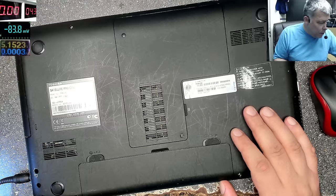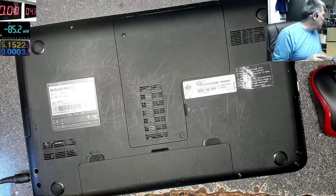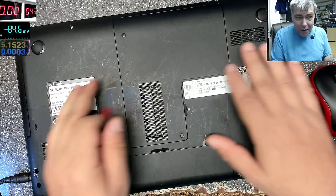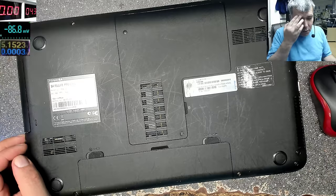But usually when you see a dirty laptop, it's actually easier to fix than a half working one, like power on, no picture. You know, this one is dead, it's most likely a problem on the power supplies or, worst case, the Super IO.